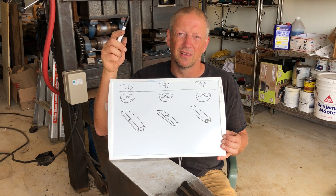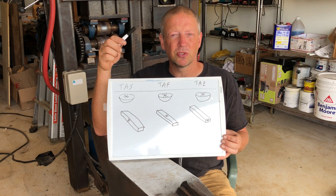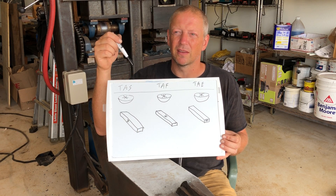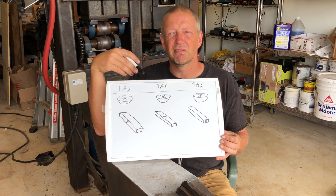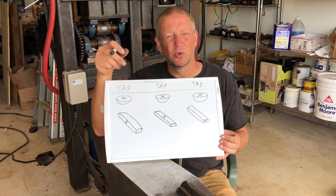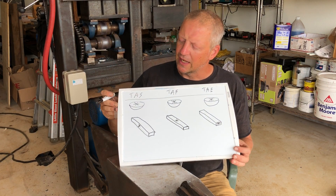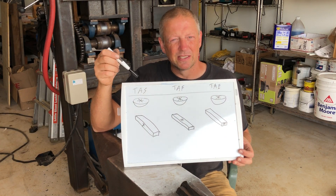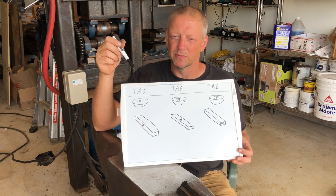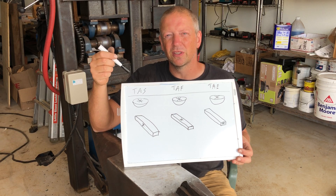Generally it's not an actual void or pipe, however you will get a lot more porosity in this area. As everything's shrinking up, you get areas that are essentially trapped and as the steel solidifies it leaves a little void. If you work the ingot properly you can close up most of those, but that area in the top center is very prone to cracking during the forging process. The odd shape of a wootz ingot makes cracking even more likely.